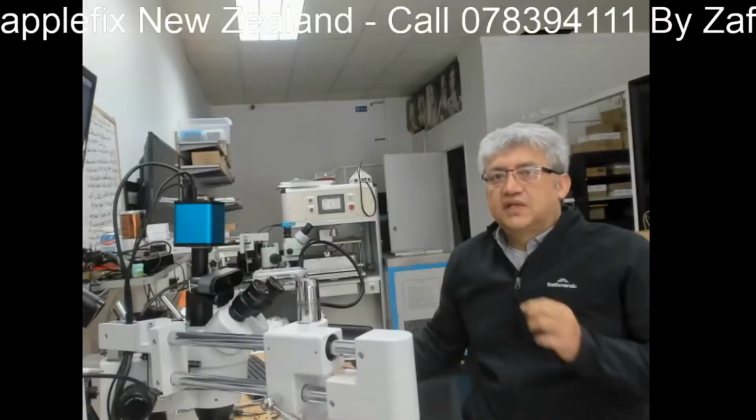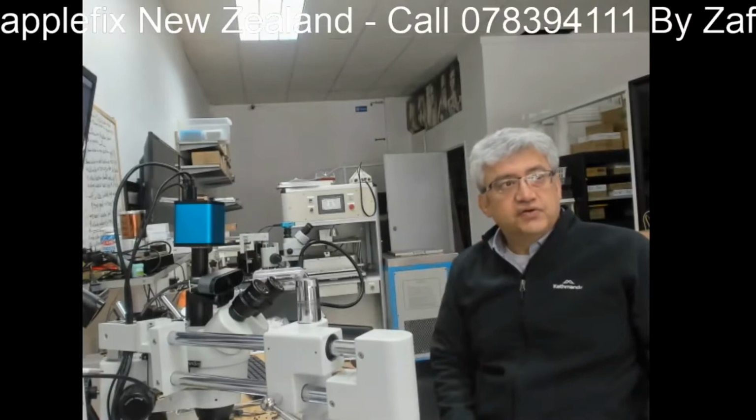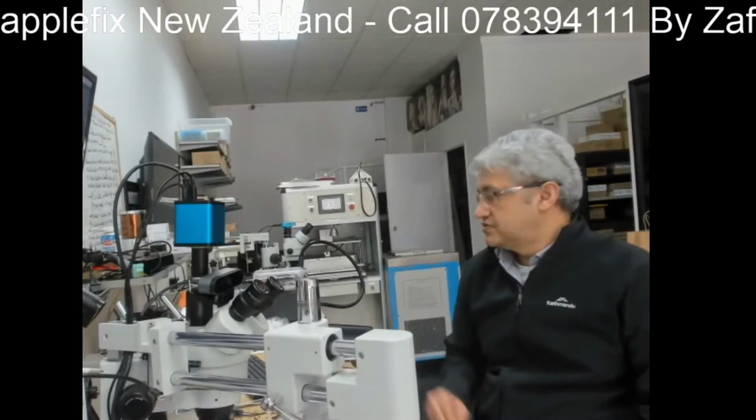So we have replaced the backlight IC on a MacBook Air A1466, which is board number 820-00165. And hopefully it should work now, because that was moisture damage. And yeah, so see how it goes. So I will put you here.